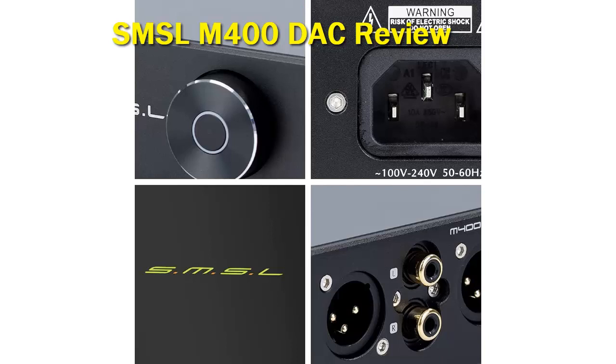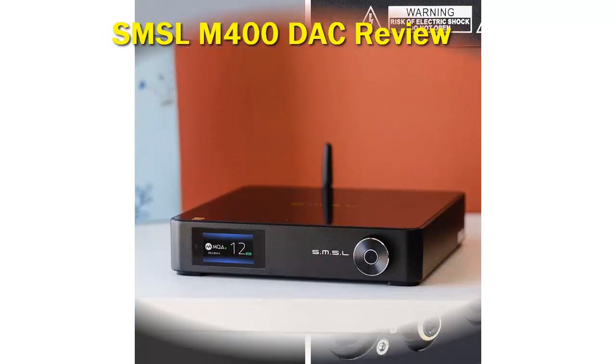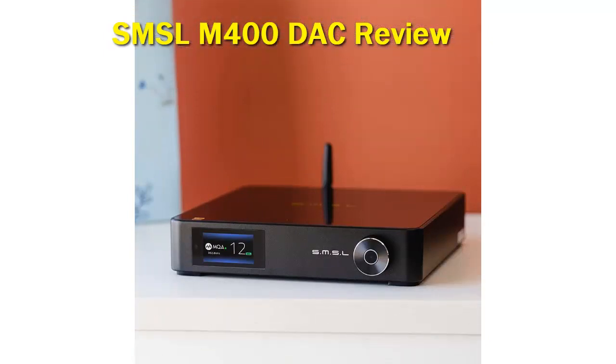Features. SMSL M400 uses a flagship Asahi Kasei DA conversion chip, AK4499. The USB input uses the second generation XMOS XU216, and I don't think there's any format I could think of that's not supported. That includes both PCM and native DSD, all the way to insanely high bit rates and sample rates that are not even really used in the music industry. MQA unfolding is fully supported too if you're into Tidal and their compressed high-res files. Finally, Bluetooth supports LDAC, aptX HD, SBC, AAC, and UAT formats.